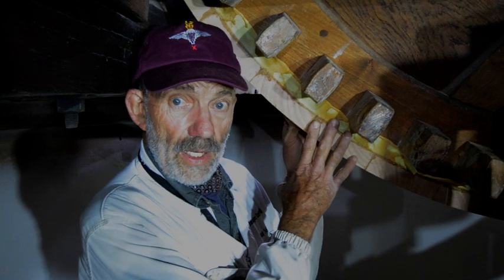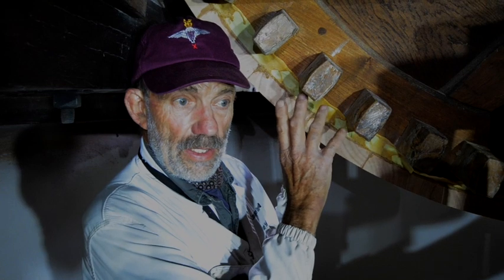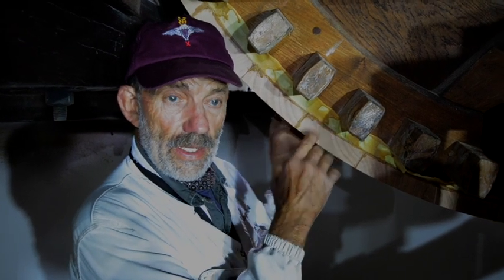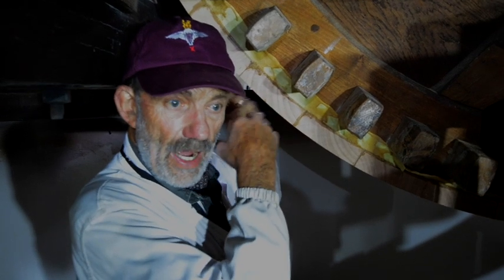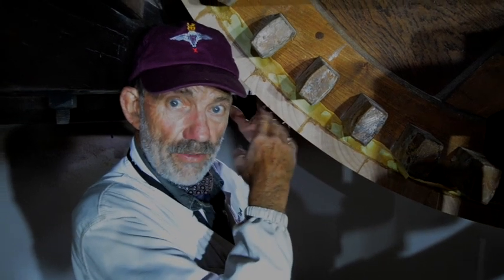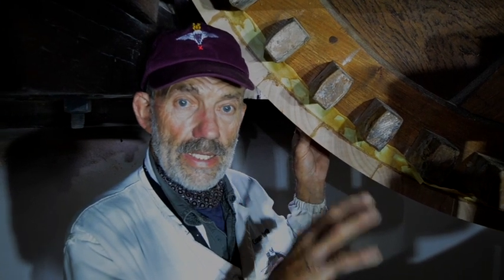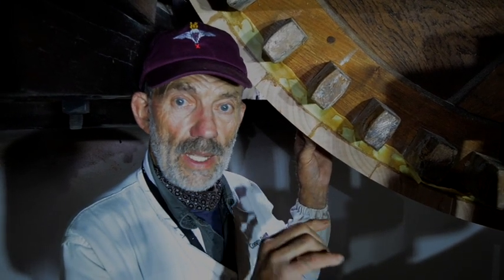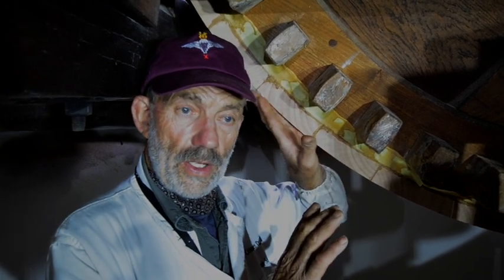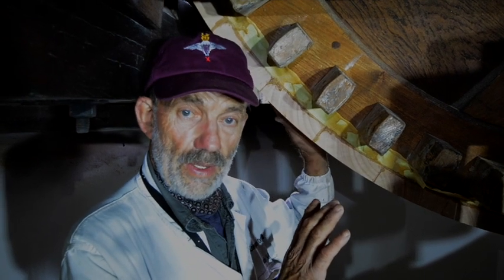Here the blocks are — they're attached to the brake wheel. We came back the next visit and naturally the outside of each of the blocks was flat, so there was a series of flats on the outside. We set up on the lathe an attachment for my electric planer which we were able to run across the surface of these flats of the brake wheel.